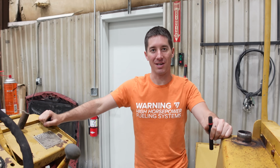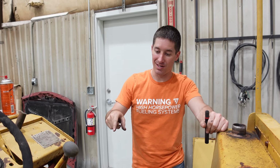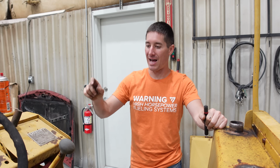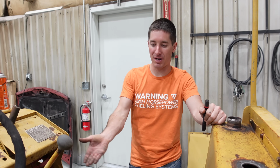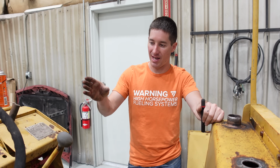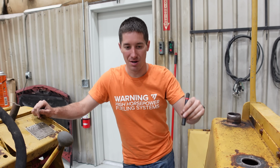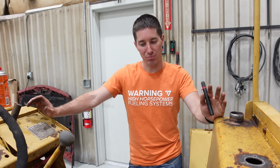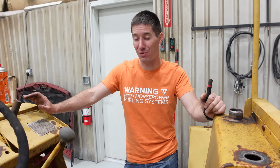Clutch works, we got that done yesterday or the day before, and there is a clutch switch, and I think that interrupts the starter circuit. So before, it would never crank, and the clutch pedal wouldn't move. None of the pedals would move at all previously. After we soaked all those in oil, we got the clutch running and the brake running, and it's building brake pressure, it seems. We filled it with our O'Reilly's DOT 3 over there, and we need to probably drain it one more time. We're still getting trash out of the brake system. You saw how terrible that was.